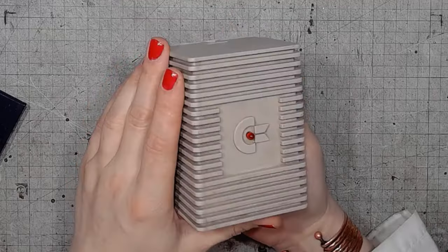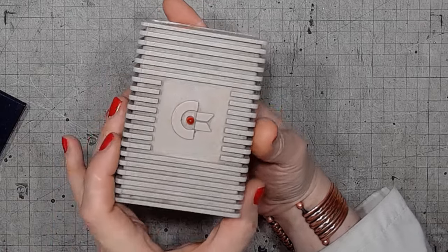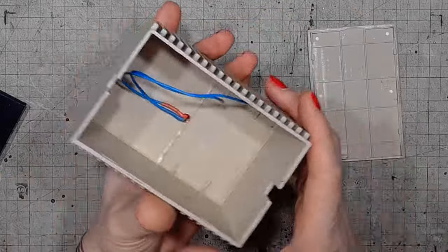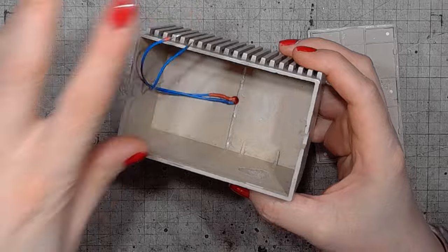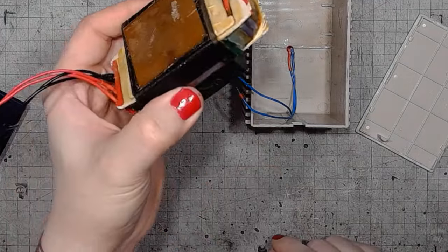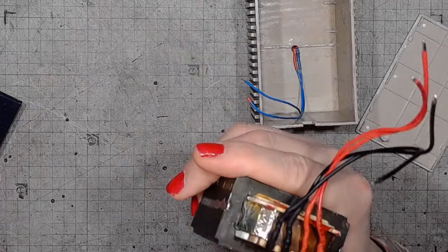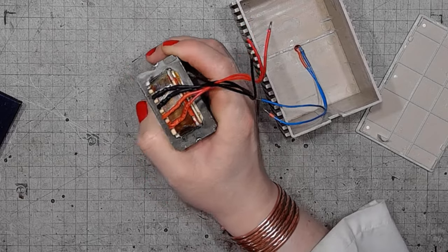Gotcha. So this is the enclosure from the Commodore 64 with an additional LED. I had to make a hole to be able to remove the innards, so I might as well add a pilot light. And this is how it looks like. The anode and the cathode. What I also have here is a teeny tiny bit biggish transformer from some audio device with windings customized. Both the black and the red winding are 9 volts, like the original.